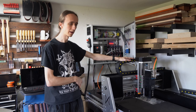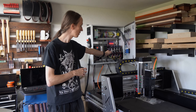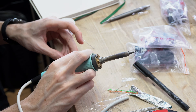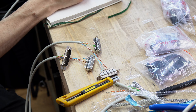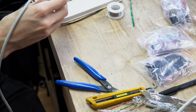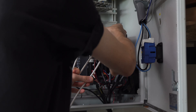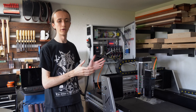You have the three wires plus protective earth for the motor itself, and then the sensor cables that come back have a convenient little plug so you just need to plug those in. What is a bit annoying to wire up are the data inputs and outputs - they give you a spare connector and tell you to solder it up, and that connector has a lot of pins: three rows of closely spaced pins. One big advantage of EtherCAT would be just plugging an ethernet cable into your controller, and LeadShine does offer EtherCAT versions of the same drives.